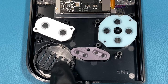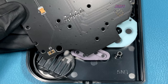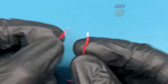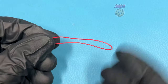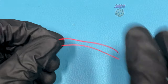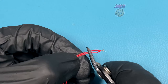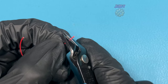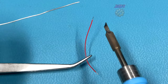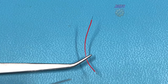In previous kits the speaker actually comes attached, but for some reason mine did not, nor was one provided. I've got some random bits of wire here — let's prep them for the speaker. First I'm going to cut the wire into two because we don't need it that long, then cut off the old ends in case they're oxidized. With the old ends cut off I'm now going to prep the new ends to be soldered. I'll use my cutters to remove the plastic shielding, then tin the tips — doing this to both wires.